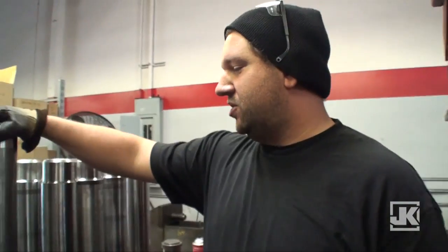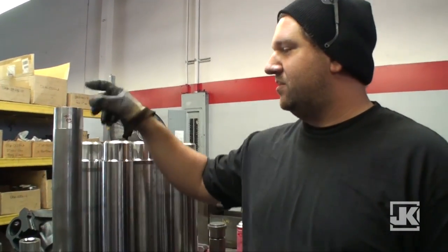I'm Matt Green with Dynatrac Performance Products. I'm a welder fabricator. So what are we going to be looking at first? We're going to be pressing end forgings on tubes to start the process of housing construction. First step is machining the tubes. Brian handles that in the machine shop. I'm going to press the end forgings on in this press and then machine them down to the clearances.